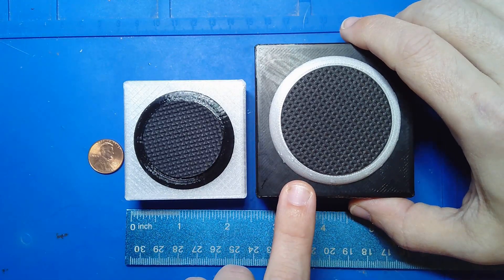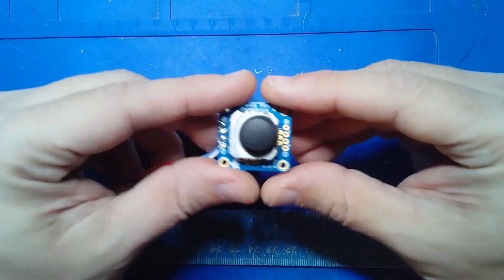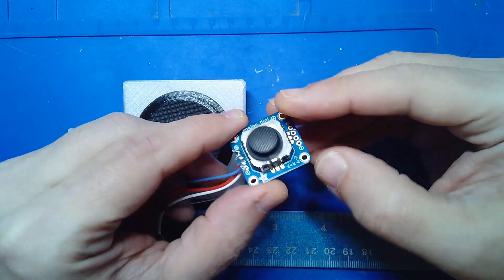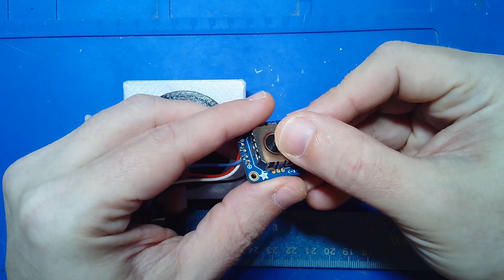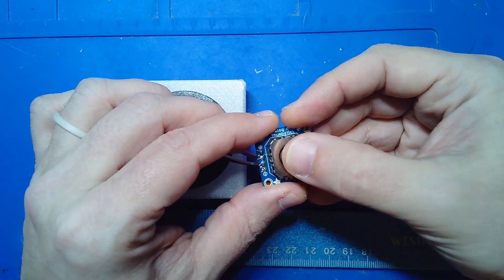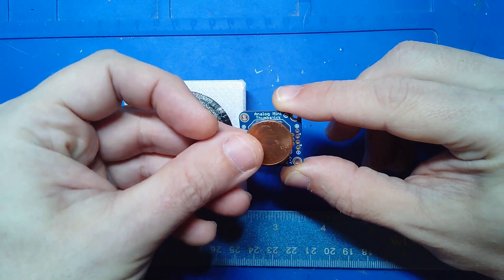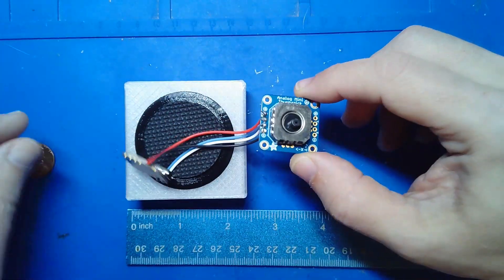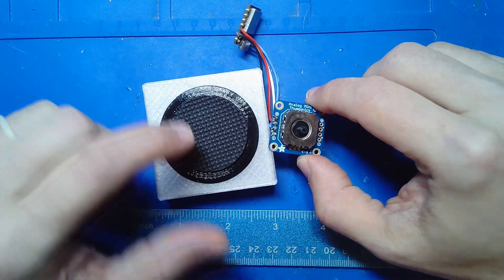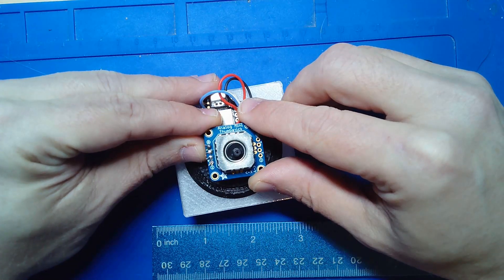So I made the big one, which made people happy. But then folks were asking, what about smaller? Let's take a look at the mechanism. Inside the joystick is one of these analog slider thumbsticks. These originally came out of the world of the original PlayStation Portable. This particular one I've removed the centering spring on, so it's not auto-center, but the normal one centers. It's pretty small, but not super small — the footprint of the stick part itself is about a penny. From an enclosure standpoint, I can't go much smaller than this enclosure because I have to fit the microcontroller board and mount the stick itself in there.